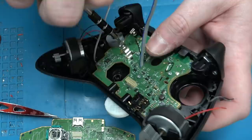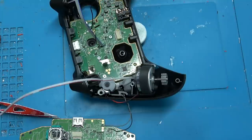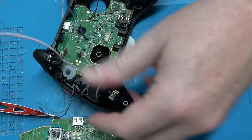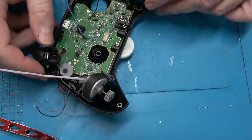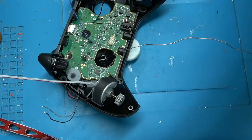I started on what's like the last microcontroller — kind of a Mad Max apocalypse thing, where the apocalypse is now. I went on DigiKey, which reminded me of the Dave Jones video where he did jelly bean components. I was trying to find the most plentiful microcontroller right now — a Cortex ARM Cortex M0. I found one: a dinky little SAM D11C — a 14-pin chip with USB. I was like, what the heck would you do with this? Which is probably why they had so many in stock.